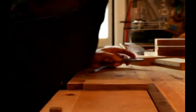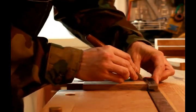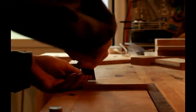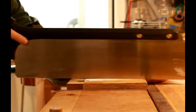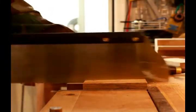That's not a chisel — got out my marking knife. I cut those lines a little deeper so that it would be easier to make my knife wall with the chisel. I made my knife wall. I got out the same rip saw again because I'm cutting with the grain. And then I started to cut that little L part into the fence.